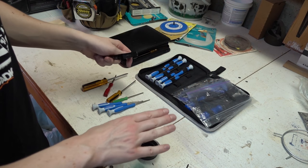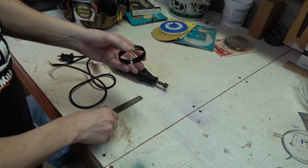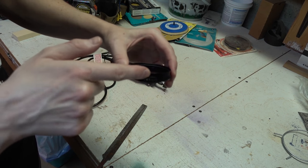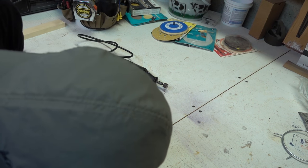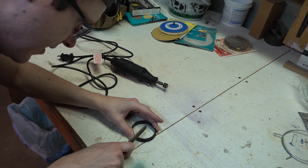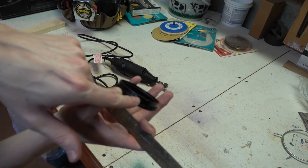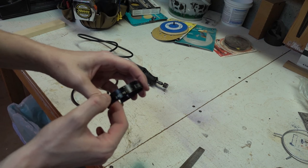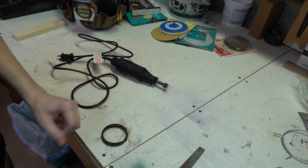I'm going to take off this piece right here, being very careful not to lose those tiny screws. Now I have the aperture ring. I'm going to take the lens and the cap with all the screws out of the area. Now I'm going to use a metal file to make a notch. You want to make sure to notch the side opposite the numbers. I'm going to take the file and use the edge to very carefully line up and start making a notch. You don't need to go past the screw holes. I'm going to go over and notch it again, which will give me access to the area I want to grind away with the Dremel.